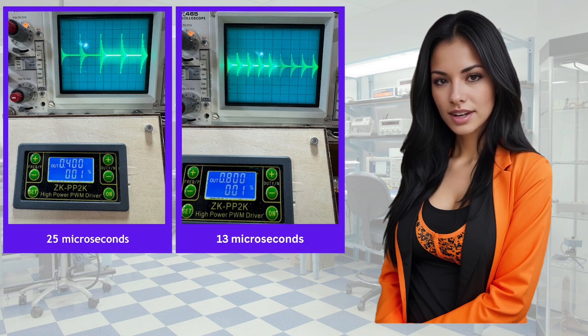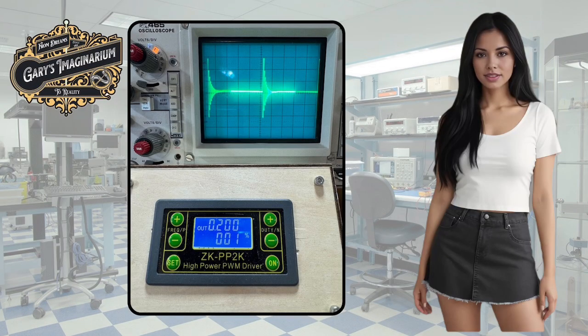This concludes our testing report. For more in-depth test results, see our website — the link is below. After documenting these tests, the final finding is that our 4-coil mat achieves its best response with a 50 microsecond pulse, generating maximum Gauss and the desired damped wave necessary for an effective healing pulse. It's important to note that achieving perfect inductance in a coil is impossible due to inherent capacitance, which determines its resonance frequency. The 50 microsecond pulse seems to ping the coil at its resonance, like the fine tuning of a bell. However, achieving this 50 microsecond pulse is only possible at 200 Hz when using the ZK module, and optimal healing requires producing pulses randomly between 6 Hz and 0.25 Hz. Therefore, the ZKPP 2K module and its pulse width modulation are inadequate for ensuring the safe operation of a PEMF device.